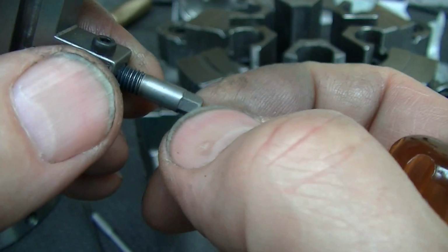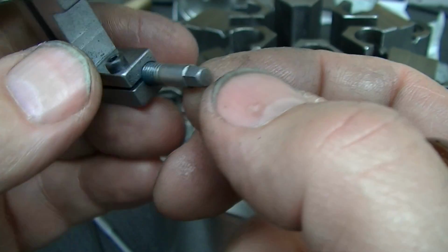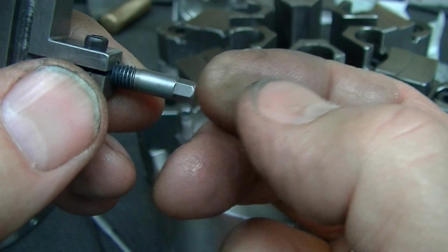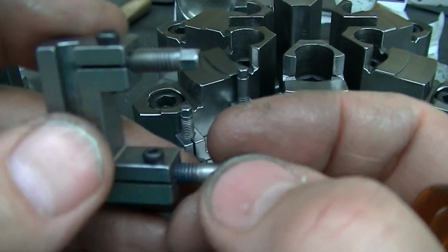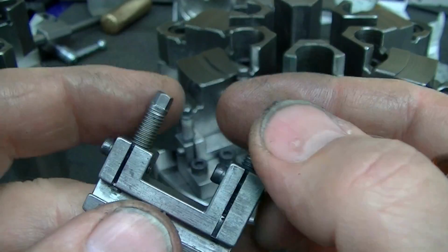Now this material also hardens reasonably hard anyhow. I just quenched them in water. That's probably a little extreme quench rate for this material, but I just wanted them to be hard so that they stood up nicely. So just some pointers about realizing that stuff doesn't just instantaneously put a deep case on. So those screws are made.